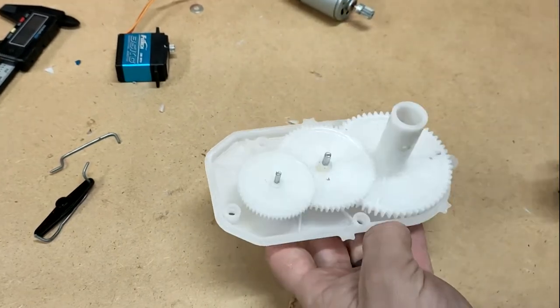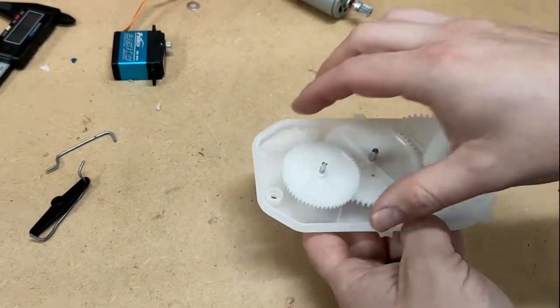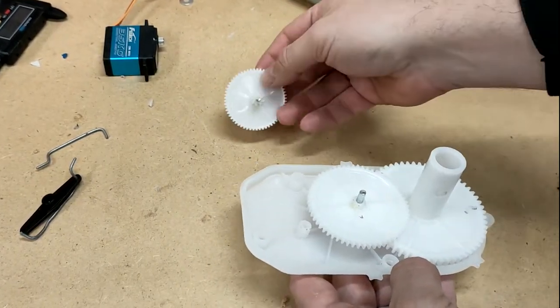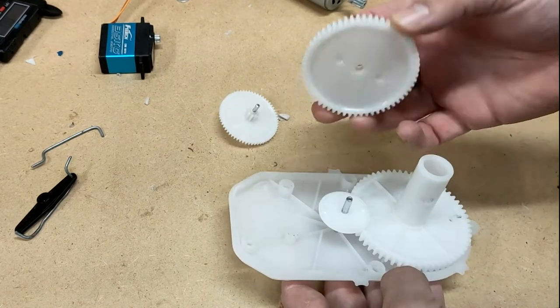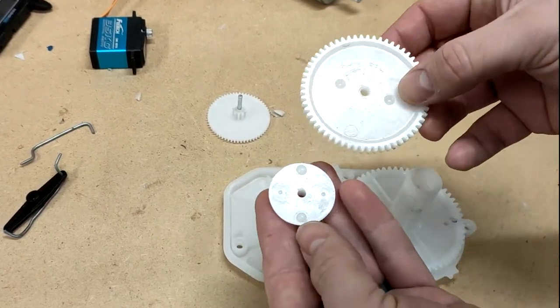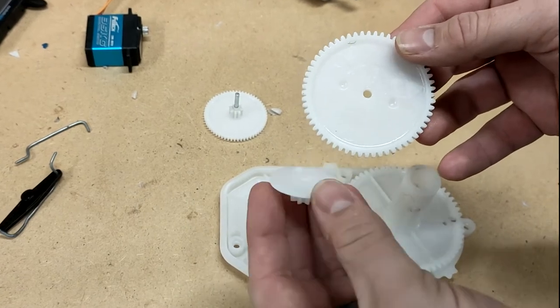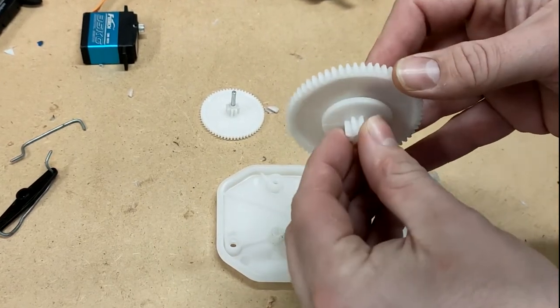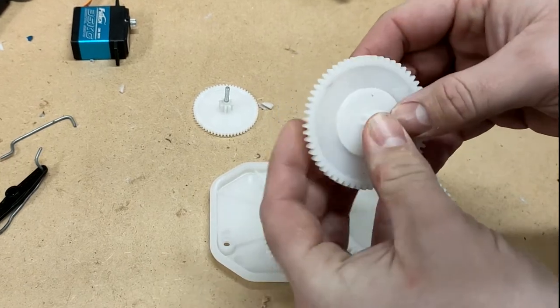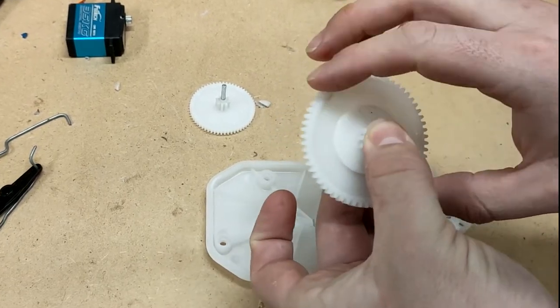What there is in this gear is like a kind of clutch — I use that in a very loose term. Let's take it apart and then we'll see. You see this gear is in two parts, and you've got these two little sort of divots in this one and these two bollocks in that one, and basically that engages the two bits together, and there's a spring that pushes them together, so it's like a little spring clutch.